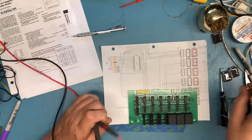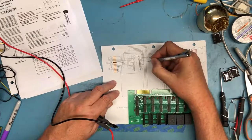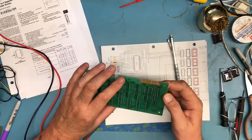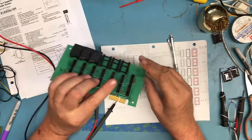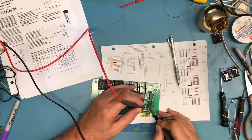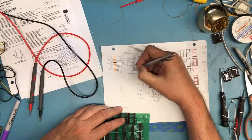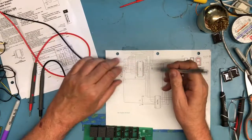The power bus here is the wider width, so based on that we know that 19 is simply tied to ground. What we don't know is where pin 1 goes. No, shoot, there's no trace on that side. It looks like there is a trace up under the board, and it looked like a fairly heavy trace. Oh, I just didn't buzz it out well. So pin 1 is also grounded. I did not leave myself a lot of room to draw this in. So the enables for the 81LS95 are both grounded, so it's always active. It's taking the inputs and driving the outputs, which is fine.